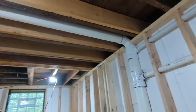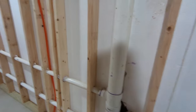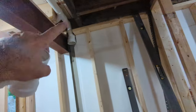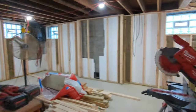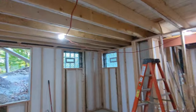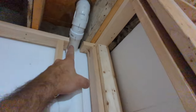So anyway, that's all built from the upstairs bathroom, the second floor bathroom, all the way down. 4-inch stack is complete all the way out, which is nice. So I'm going to get this vent tied in and then make sure we're glued up and over the concrete pilaster there, which was going to be, I can't remember exactly. I believe I did glue that. It's like there was no point to not. But somewhere there it becomes unglued. I'd like to think that's even glued back there.